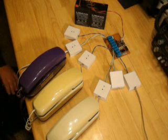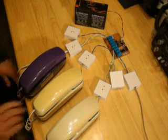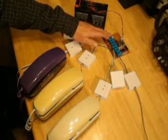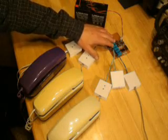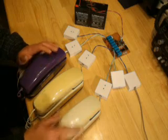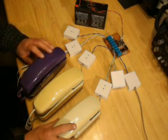Here's another one of my little projects that I recently finished. It's a telephone intercom system. I have several telephones here. The board that I designed will accommodate up to eight different phones, and most of what's on the circuit here is for signaling the other phones. It's pretty easy to wire several phones together so that you can talk between them, but the signaling is usually the critical part.